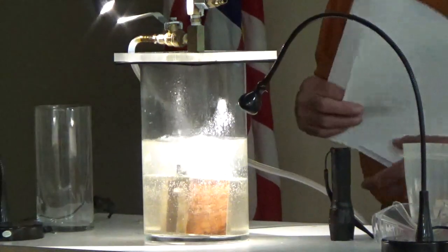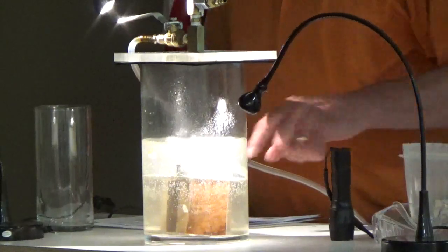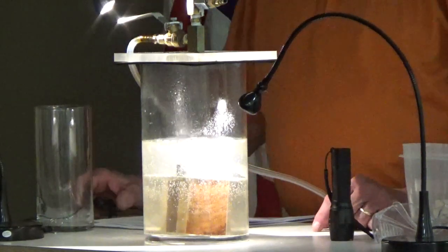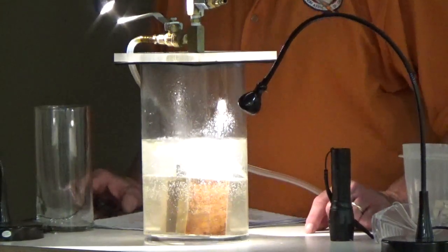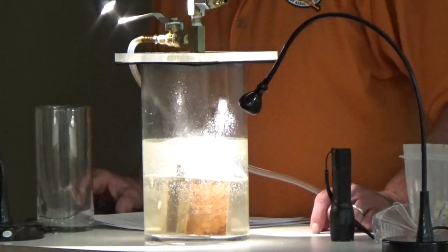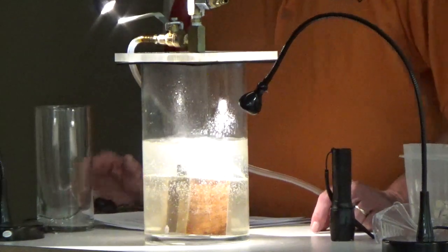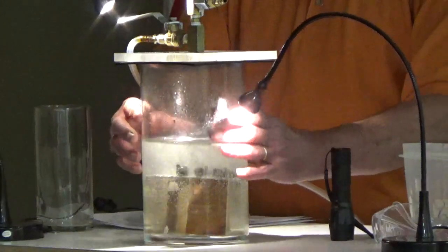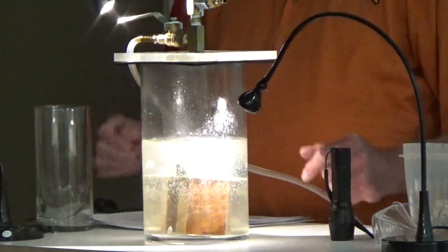I'm glad to see that thing worked at holding them down, because I put some lead shot in the thing, glued them in there so that it would help with the weight. I was concerned about it. I don't usually do big blocks of wood like that, and don't usually have a problem with them being held down with just the steel. If you buy a commercial thing like Turntex makes, he's got a weight, not really a weight, it's a plastic thing that goes down inside, and it pushes out against the chamber and kind of locks in place.